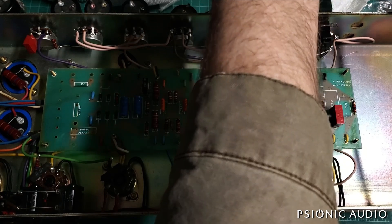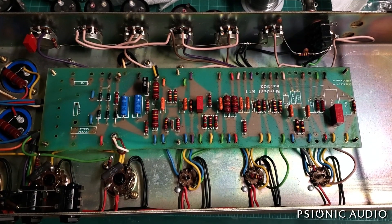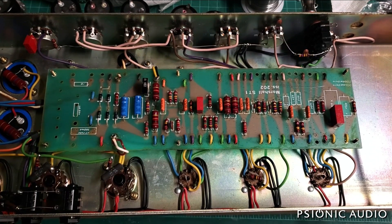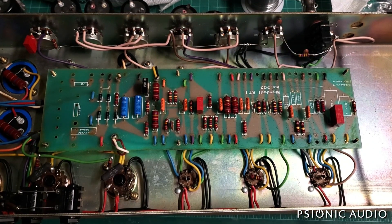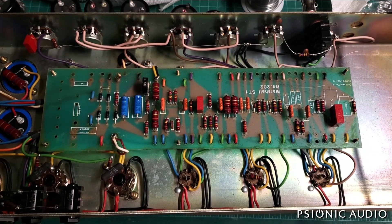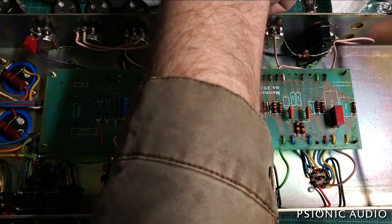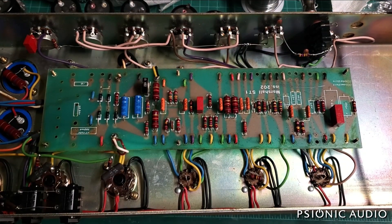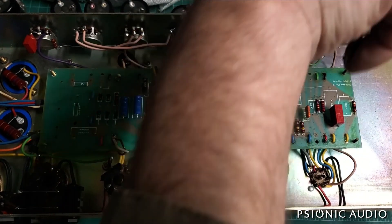Let's have that about three o'clock and just loud enough to hear. This is with a single coil. That microphonics is very slight. Overall, I think the amp is sounding very, very healthy. But my God, that is a cold, cold bias.